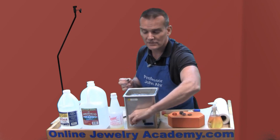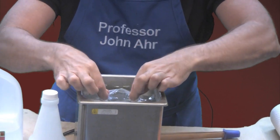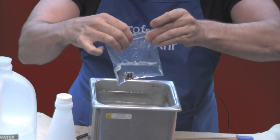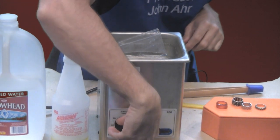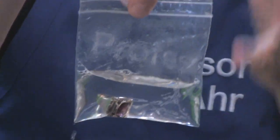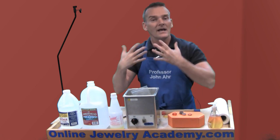Here's another cool trick — I have to turn off the ultrasonic to show you this one. If you're cleaning a diamond wedding ring and you're afraid stones might fall out, take a bag that you'd normally use to package work to send out to a client or another jeweler, fill it up partway with solution from the tank, drop the ring in, and then close the bag tightly, leaving enough room for air so the bag floats in the tank. The pressure is reduced. If anything falls out, when you remove the bag from the tank all the stones — if any have fallen out of the setting — will be in the bag. Just clip the corner and let it drain, and all the parts are still there so you can easily have the stone reset.